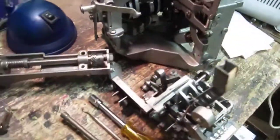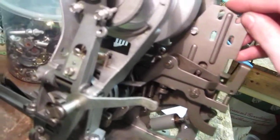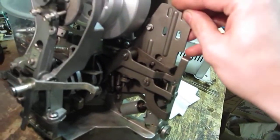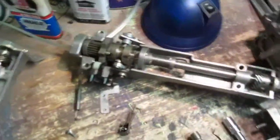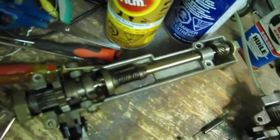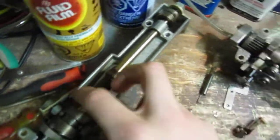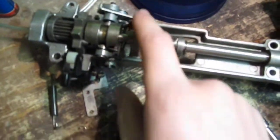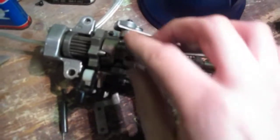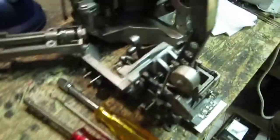There's a lot to be explained and I don't want to miss every detail. I spent quite a number of hours putting this whole mechanism back together and cleaning each part — it can be a nightmare depending on the shape it's in, but it's well worth it. This is the clutch here, one of the more important pieces, and over here is another clutch from the other machine. This is what it used to look like — it still works, but you can feel a lot of resistance inside the bearings. The only way to get rid of that is to fully clean each and every part, because it's almost like a cement that builds up inside. This one moves pretty freely.